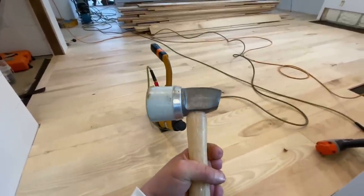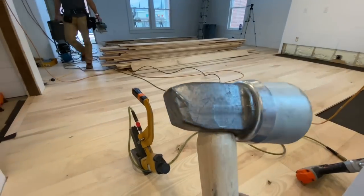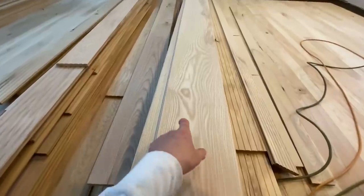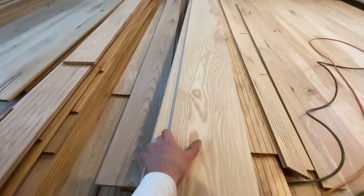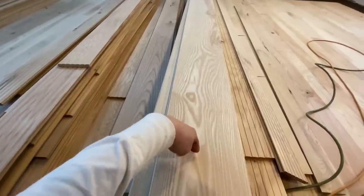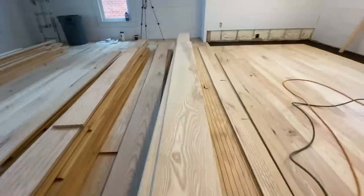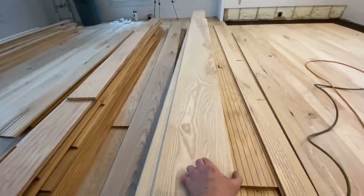I want to talk about this mallet quickly. The rubber side is primarily for hitting the nailer. The metal side is for hitting your boards in tight - it's tapered so that you don't hit the top edge of your wood; you hit the bottom edge where it won't be seen in case you put a dent in it. These really wide boards - the widest ones are eight inches wide - would be quite prone to cupping. So what we're going to do, as recommended, is actually face nail them in the middle of the board. Not just straight down, because a nail straight up and down can squeak and be loose - you fire one this way at an angle and the other way; we call that crossing it up, down the length of the board. About every two feet we'll shoot two crossed nails, and that holds the middle of the board from lifting up from the floor.